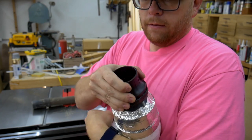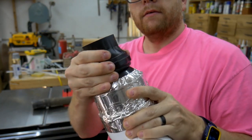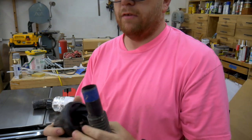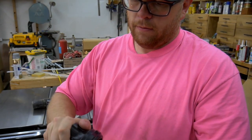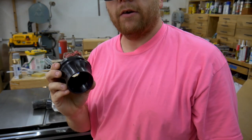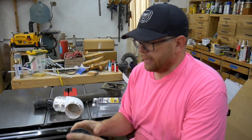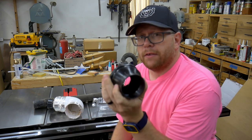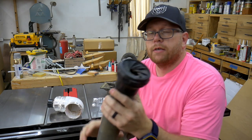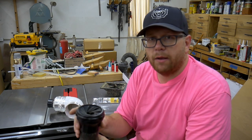Since it's got like the rubbery diaphragm on the inside, it makes a nice tight seal. And it's adjustable, so I can go from that roughly 2.5-inch fitting, even all the way down to this 1.25 fitting. So these are very nice. I'm not sponsored. However, these are also very expensive, relatively speaking. I think maybe I paid $8 or $10 for this, and I bought this one for a very specific purpose, because this end will fit onto a standard shop vac hose. The other end I'm going to put on to my DeWalt planer right there, because I always have problems with the hose slipping off.